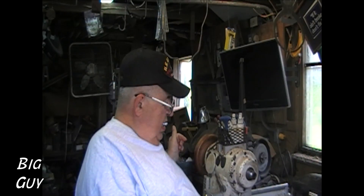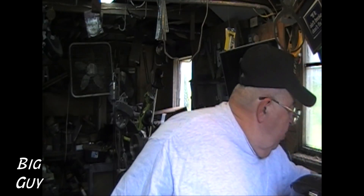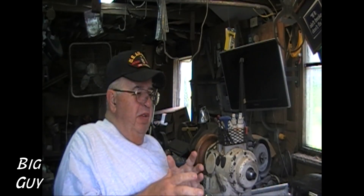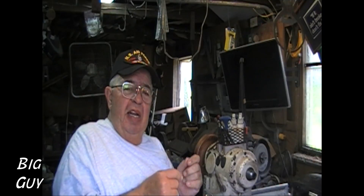The draw bar goes through my headstock and pulls the Morse taper into it tighter, so it won't vibrate and doesn't have the tendency when I change the direction of the tool to pull away and create vibration. Those draw bars also work for drill chucks. I found some stock I thought I'd lost — it was right there in plain sight. I have several gizmos and gadgets that go through the headstock, and if I'm using particular pen mandrels — like the adjustable pen mandrel — I'll get it and we'll use a draw bar.